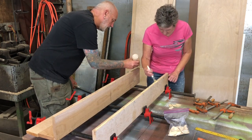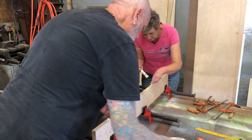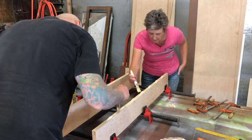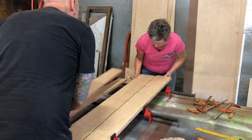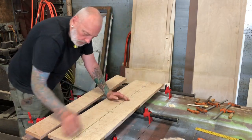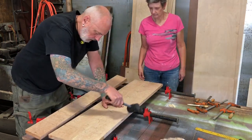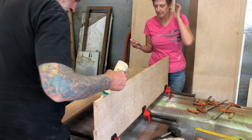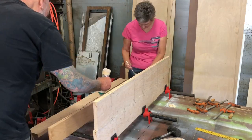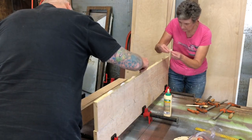You need to be organized and ready to get this together as quickly as you can because you don't want the first glue joints getting too dry while you're getting the rest of them together. That's why I asked Shelly to give me a hand. We went through and glued all the joints, knocked them together, and then used gravity — we just tipped these up on their edges so we didn't have to fight with the glue running down all over the place. We made sure to get glue down in the biscuit cavities and on both edges so everything's nice and wet, giving us more open time to get it together.